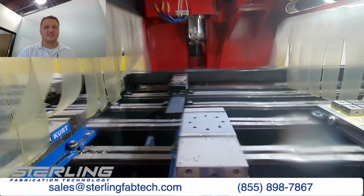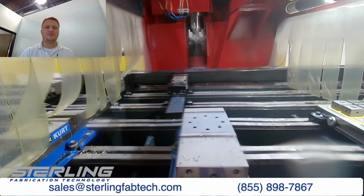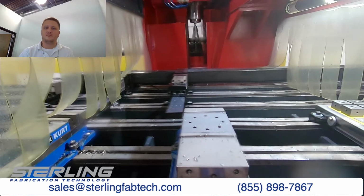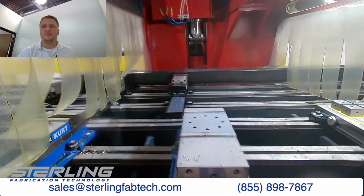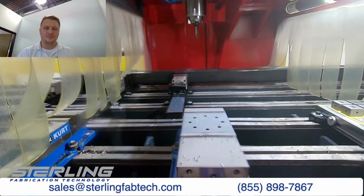So Eddie, while you were talking there, we went ahead and drilled the bolt circle pattern with the 27/64 drill. And then the next drill is a 3/4 inch Allied Machine and Engineering tool. It's a Gen 3 drill. The Gen 3 style drill is very good for high feed rate, and you'll see that here in just a second.